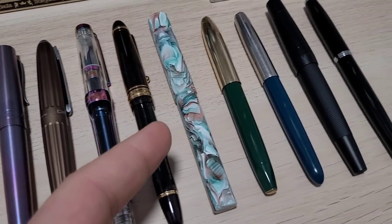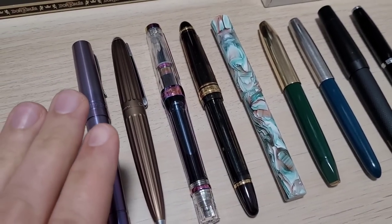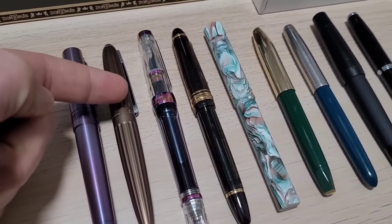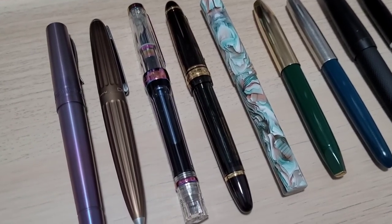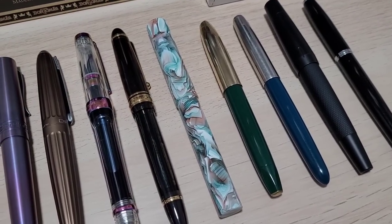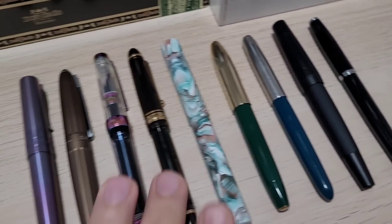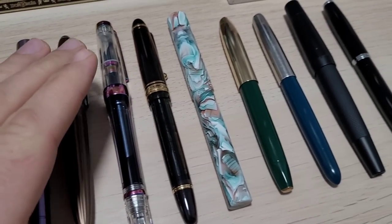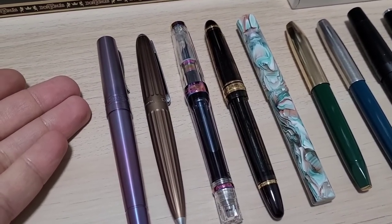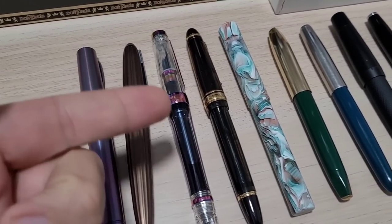The way I look at pens, I break it into a few different categories. There are many things that impact the quality and long-term outcome of a pen. We're going to talk about materials — most common are metals or plastics — different cap types, snap caps and threaded caps, mixing materials like plastic and metal together, and then the finish of pens, whether it's an anodized coating or painted. Also the overall fitment — things to be aware of, how to look up close and spot issues from pictures when shopping online or in person. I'll explain this from an engineering perspective on what makes good pens.